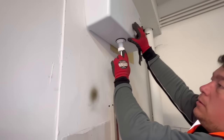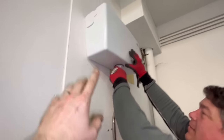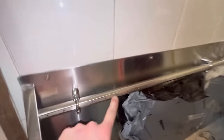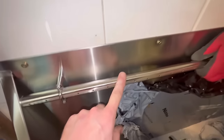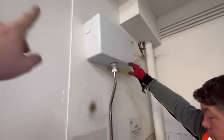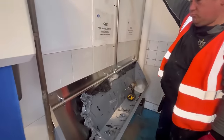Be careful — if you have to tighten that nut it'll just split, so don't over-tighten it. The system's on the wall, pipes in. These hoses here — the little holes — you have to make sure they're facing back against the wall. If you left them facing out, imagine the poor bloke using the urinal — it'd come straight at him. So make sure the face is the right way. Mark the holes — that's taken us about an hour? Better part of an hour. It's an easy job, to be fair.